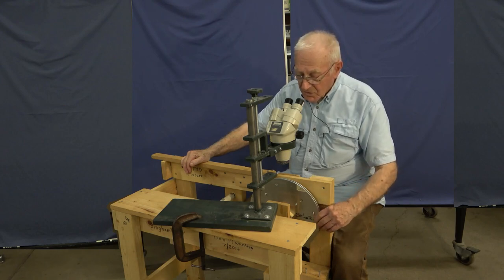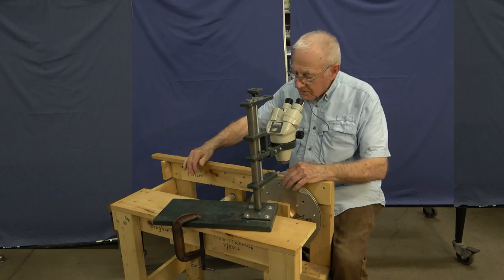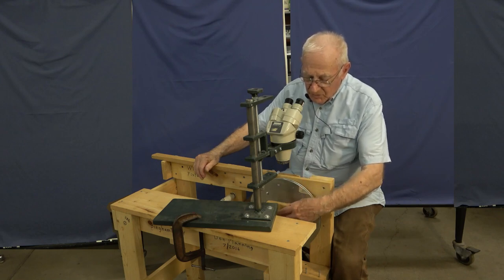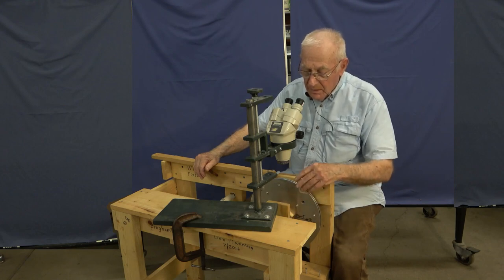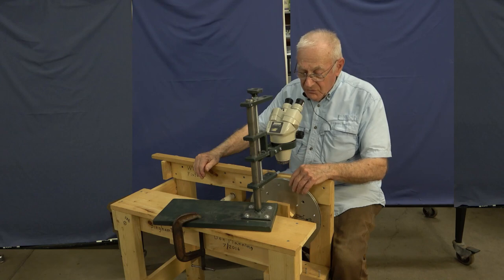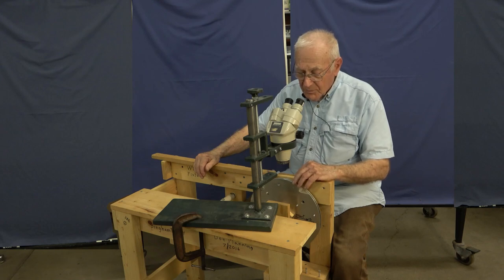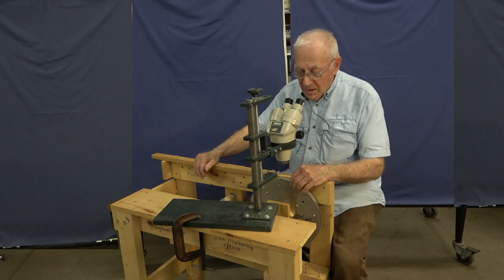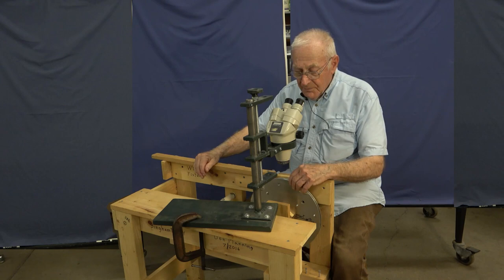What you would do next, of course, is once you have the wire disconnected from your other one, you take the mandrel off the spool, take out the axle, and take it apart. But before you take it apart, you take the same tape that you put down initially, only this time with the sticky side down against the wires. Wrap it all the way around. You have to be very careful because you don't want any lumps. It has to be nice and smooth all the way around. The trick to a good band is that it's smooth, no bumps, no irregularities, continuous. Then you have a good band.